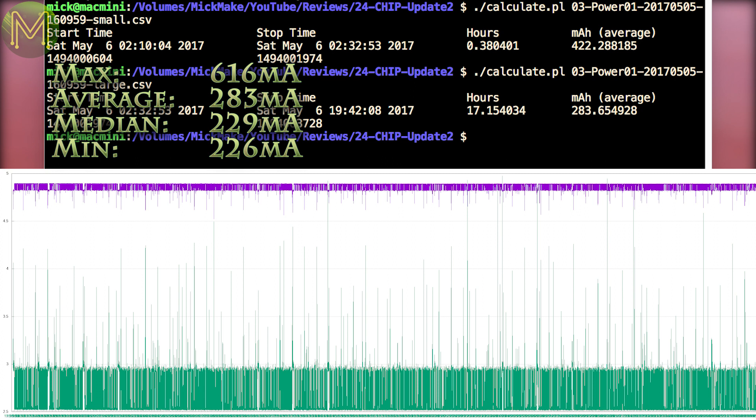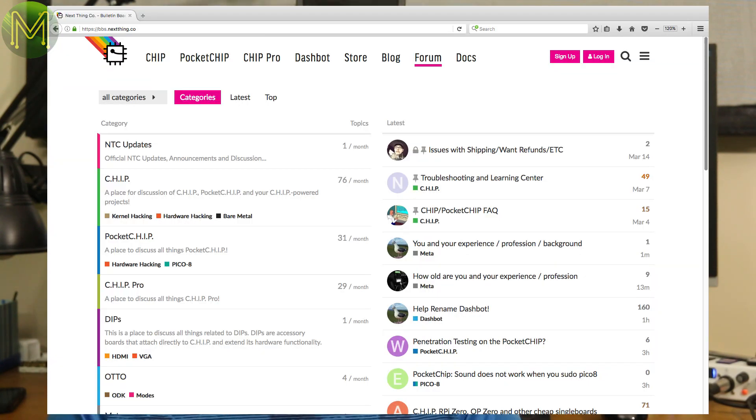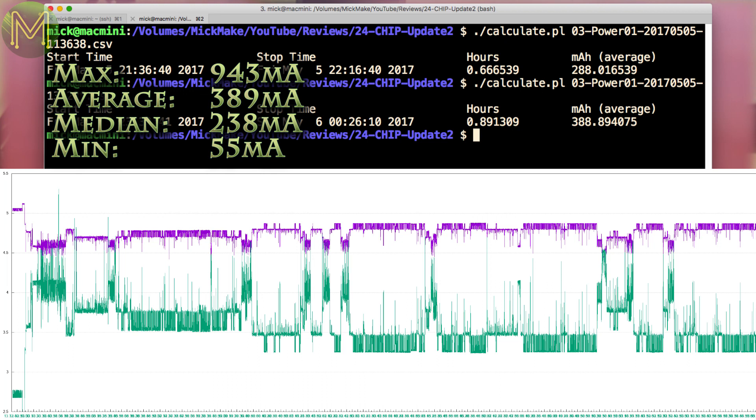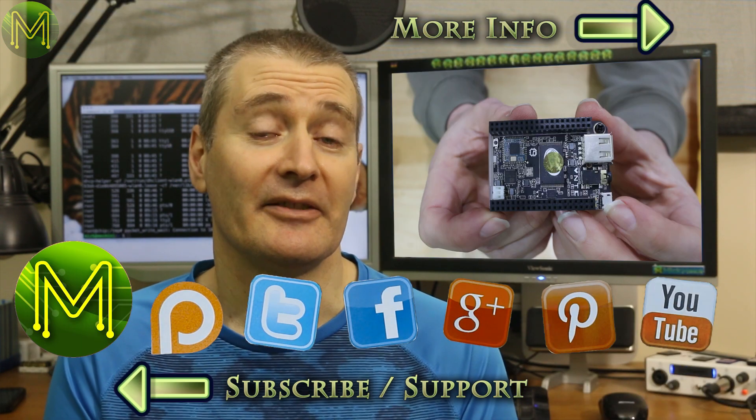This is slightly more than the Raspberry Pi Zero W at 180mA. However, the chip has the potential to pull a lot more current. The chip OS image seems to have progressed since my last review. Everything seems to work as promised from the company blurb. However, I wouldn't try to do any real work with it, as it simply doesn't have enough RAM for it to be taken seriously. It's also good to see a huge community developing behind it, and support is still pretty good. I would consider the chip fairly equal to the Pi Zero W from the support and capability perspective. However, the chip does draw more current than the Pi, so this could be an issue for some people. The Allwinner R8 datasheet mentions a super standby mode that it can enter, but there's no support for this currently on the chip. So that's about it for the review update of the chip. Thanks for watching, and see you next week.